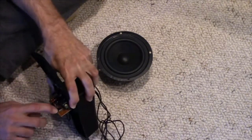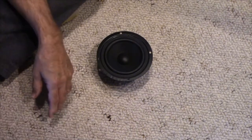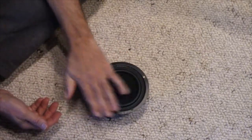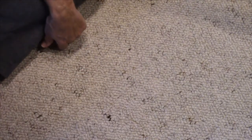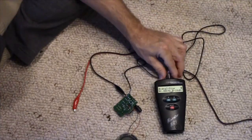What was I saying? Oh, this chip, looks like it'll generate about a half a watt into a 4-ohm load. But anyway, I think probably plenty to drive this to an obnoxious level. So that's an option. I'll have to consider it. Okay, so here's what I've done.